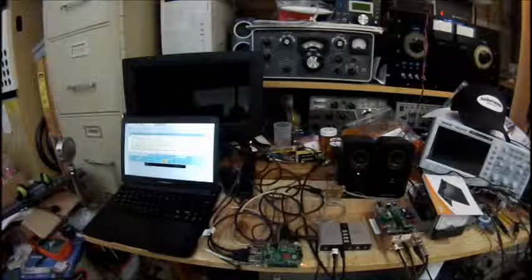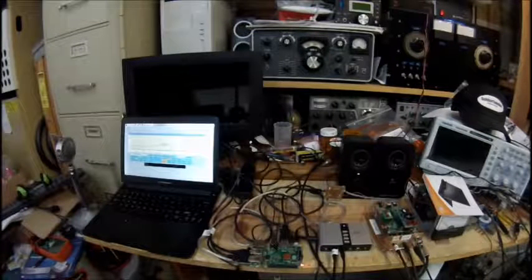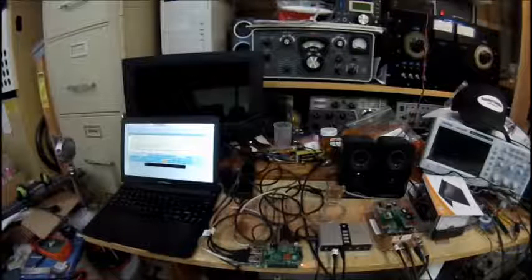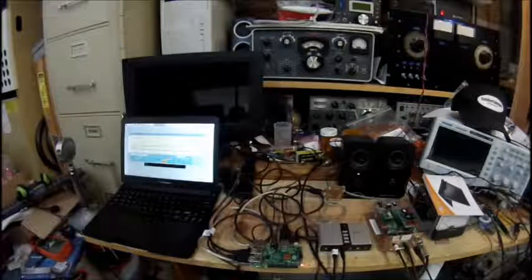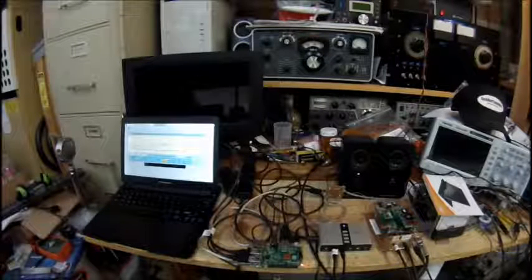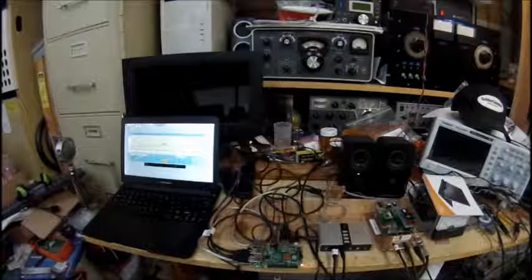This is N6QW — this is a Raspberry Pi 2 operating with the Motorola Atrix 4G lap dock, and we've got the Soft Rock V63 and StarTech 7.1. I do have a Raspberry Pi 3, but in this initial test, in case anything went wrong and I smoked something, I didn't want to smoke the Pi 3 — so the Pi 2 has been through the wars and is my test setup. I do have an external amplifier; I get about 45 watts out, and we've made a few contacts with it.